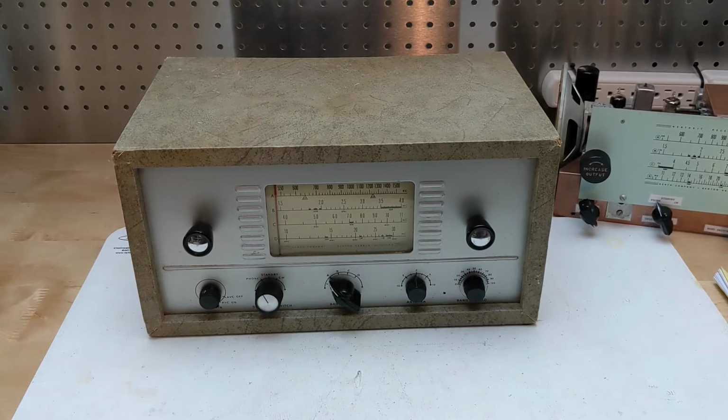The successor to the AR-2 was the AR-3, sold from 1955 to 1961 at a price of $27.95. It reduced the tube count by 1 to 5, added an antenna trimmer control and pilot lamp, and it used better coils and IF transformers to improve selectivity. It also added an octal accessory socket, which supported the optional QF1Q multiplier.